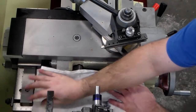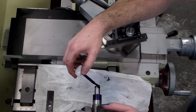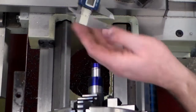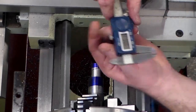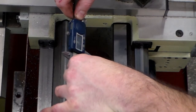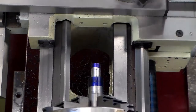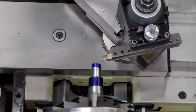Here I'm going to throw some bluing on the end of the part, then use my calipers to mark a sixteenth-inch length down the part, because the callout for this chamfer is 1/16 by 45 degrees — and that means a sixteenth of an inch down the part, not across the angle that you're cutting. That's actually a pretty common mistake that new students will make. I'd open my calipers to 0.060 — if I wasn't filming I'd say that's good enough, because when scribing a line I don't really have to land on the perfect thousandth with my caliper.